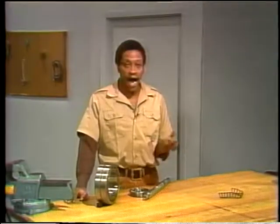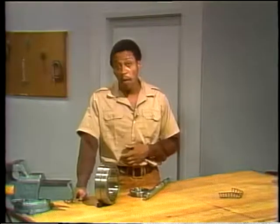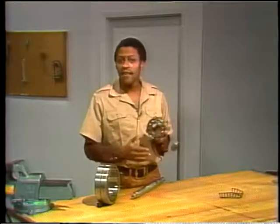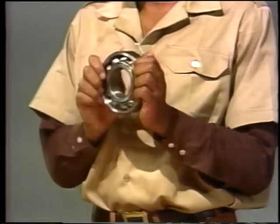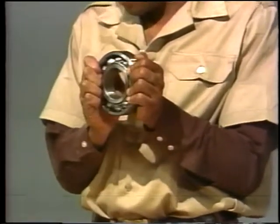The signs of fatigue failure could include any of the ones we mentioned earlier: unusually loud bearing noise and vibration, high operating temperature, burn marks, spalling on the balls or races, a bent or broken retainer, or cracks. Metal fatigue causes fatigue failure. The bearing might look rigid, but it isn't.